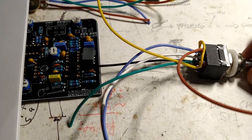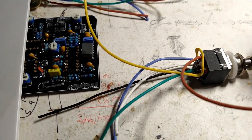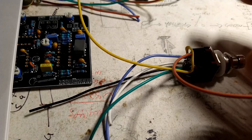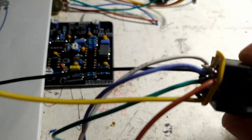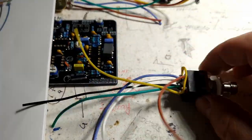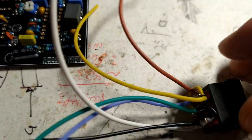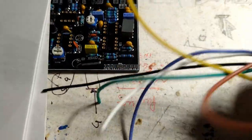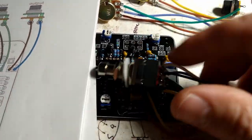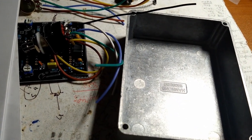If you're getting into this, thinking about doing this yourself, and you don't have a lot of experience with this kind of thing, with soldering, I would recommend you go ahead and get a kit, like one of these multi-kits of wire, but get solid wire, because it'll make the soldering and the connecting of the wire a lot easier. I used stranded wire because I'm able to get the connections good enough. I don't mind putting in a little more effort here, but with the stranded wire, it's more flexible, and I have bigger problems getting all the stuff to fit inside the enclosure, because you're basically putting 10 pounds of shit in a 5-pound bag.